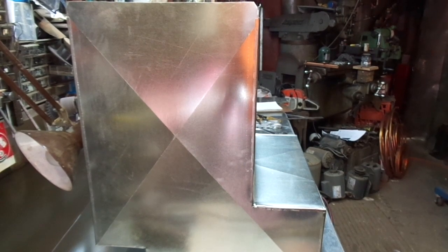This is just the first of many fittings going into this second story system. When I started this video a little while ago, I forgot to mention in the lead-in that this was part one of the second story, or the attic system sheet metal project going into my son's house. It's going to be an R410A refrigerant 410A heat pump system with a 10KW air handler, all the controls and everything necessary to cause it to function correctly — an attic install R410 split system, 10KW electric air handler, and outdoor unit.